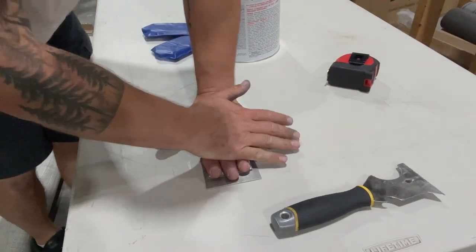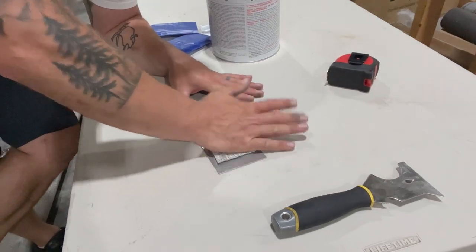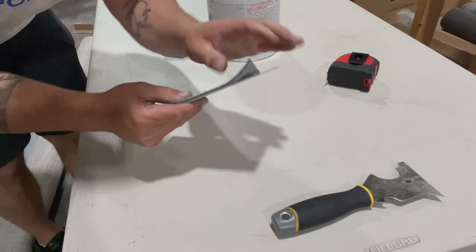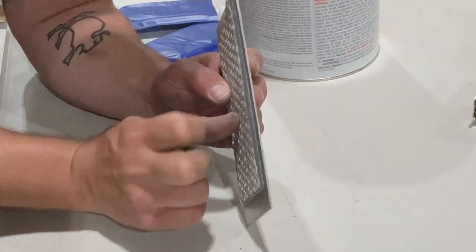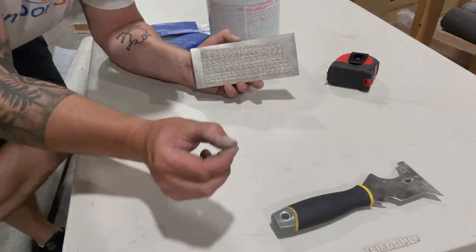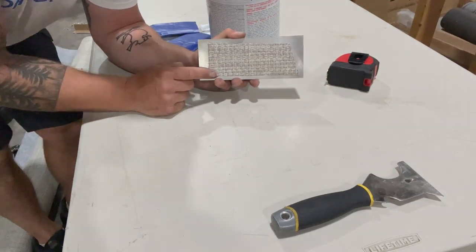Now when I join these together - that's really stuck on there. If I really work at it I could peel that back; I just stuck them together. But if I leave this here, put some weight on it, roll it out, that's going to be really hard to get apart. You can see the adhesion happening there where they're sticking together. I push back down and it's going to be stuck really well. I'm not worried about this peeling up at all. You can see me working against it and it's not going anywhere. So that's the process. It's great to test this out on a scrap piece of aluminum with a scrap piece of vinyl so you can get that timing, because if you stuck it together too soon the solvent hadn't evaporated and it would come right apart. Test this before you do your whole floor - please save yourself that hassle. Learn the timing and it's going to make your job a lot easier.